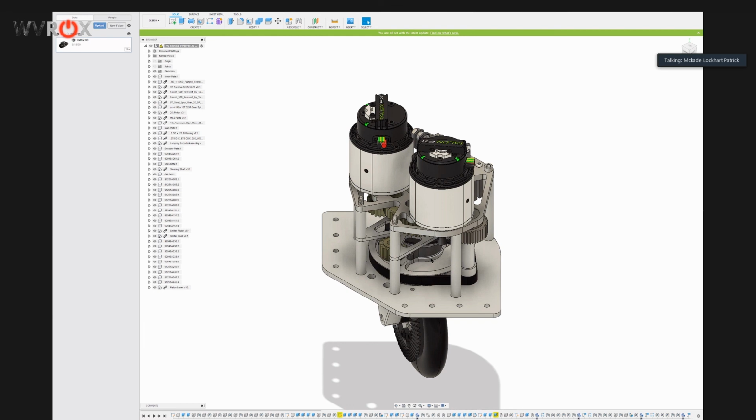We had auto targeting with the swerve, so there was coordinate positioning or transforming, and we mapped the location of our robot using our Limelight and swerve odometry on the robot, so it knew where it was. That let us use field oriented control, so that if we told the robot to drive straight down the field and we turned while doing it, it would still drive straight down the field. Yeah, that was another big code thing, having field oriented control of the robot.